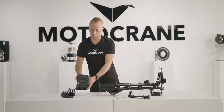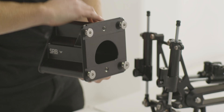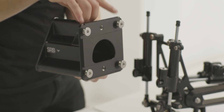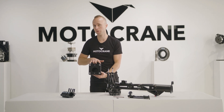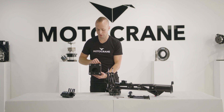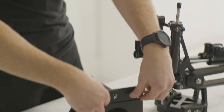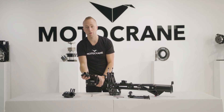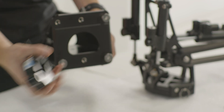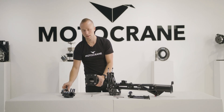On the back side of the SRB we have two different bolt patterns for mounting to single or dual speed rail setups. For a lot of the high-speed cornering chase car work we do, we really prefer dual rail setups for the robustness and rigidity inherent to that. When using dual rail, the SRB actually becomes a strengthening agent — a structural member of the rigging — which is really nice. It also includes hardware for mounting the included clamps. We include four TUV-certified speed rail clamps for one-and-a-half inch speed rail, and there's a slot that these drop into for anti-rotation, so once in place they can't rotate or skew.